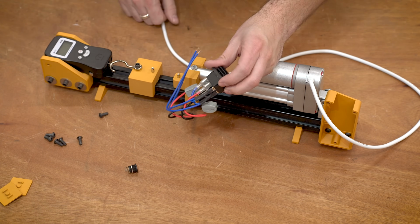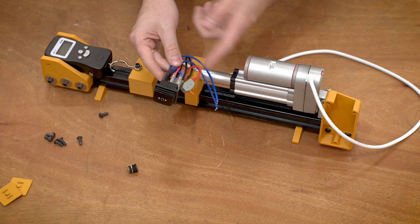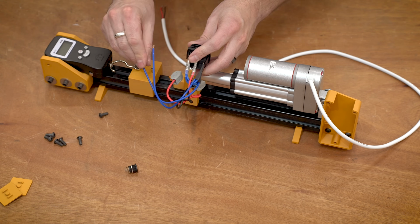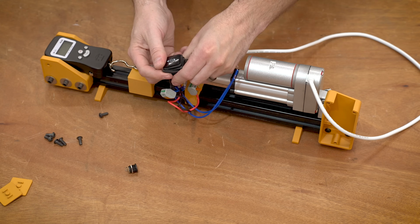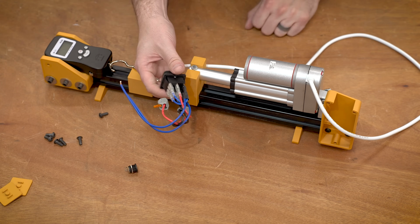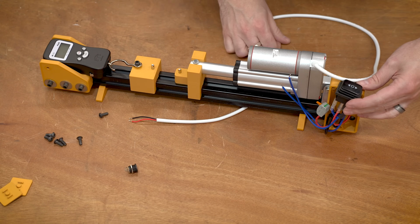I have this switch in the description. This is just a simple double-pole, double-throw momentary switch, and it's wired such that when you put power into it over here and connect this into the linear actuator, it will go one way and then go the other way. And it's just simply reversing the polarity, but these switches are really common. I have a link for one on Amazon, and that is going to fit inside of here.